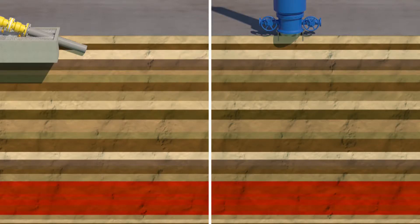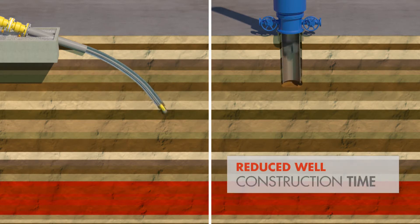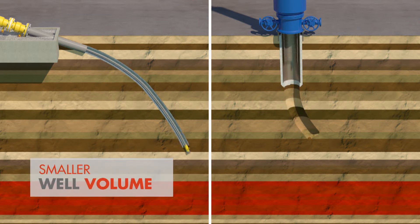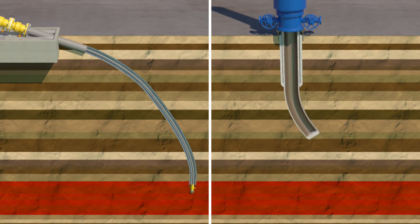So what are the advantages of using SOX when compared to conventional drilling techniques? Well, there are several. First of all, the overall construction time for the well is reduced, because changing out the bit is the only time when round trips are needed. Running casing and providing zonal isolation is done simultaneously with the drilling. Second, the volume related costs are reduced, because fewer cuttings are produced and less cement and drilling fluid is needed.